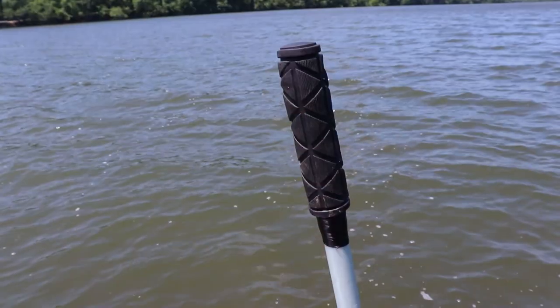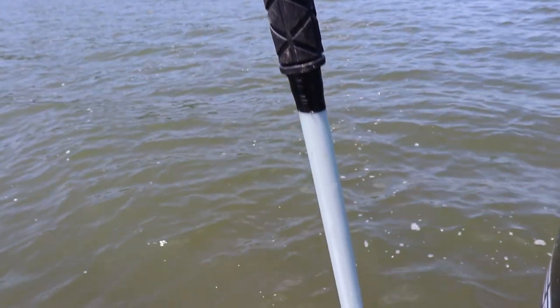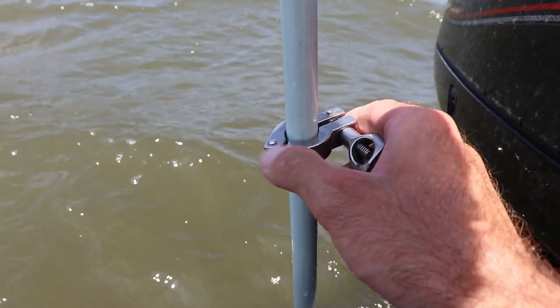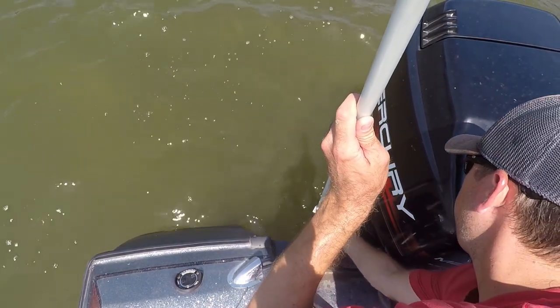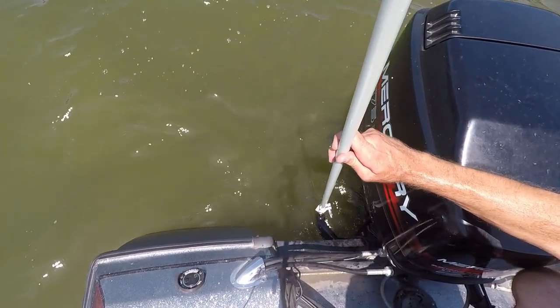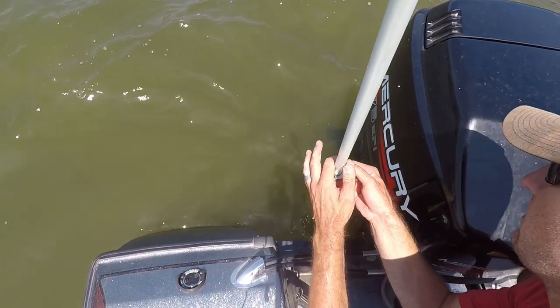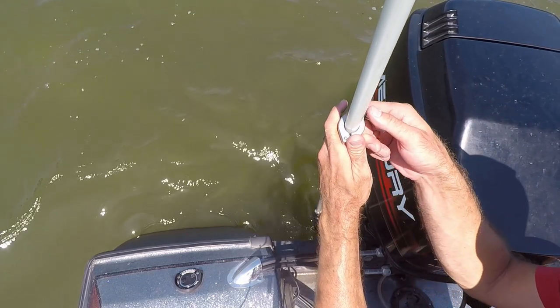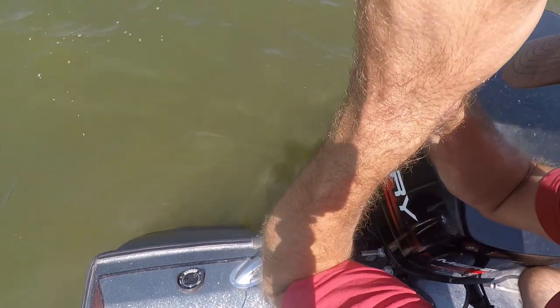It's a lot cheaper than a power pole, so it's kind of a redneck option, but it works. You do have to manually run it, but I put this grip on it for a little leverage and to soften the end so it's not blunt. The clamp system allows me to slide it down, pull the anchor up, slide that down, lock it in, and move to a different spot on the lake, reposition, and when I'm ready I can loosen the clamp, slide it up, reposition the pole, and it's out of the way without taking the pole completely out.